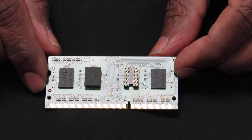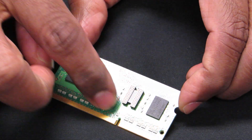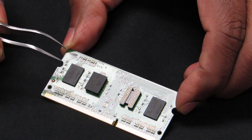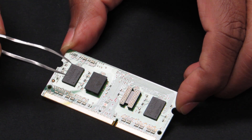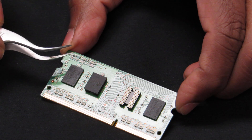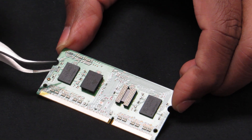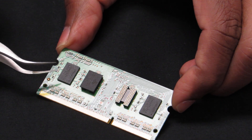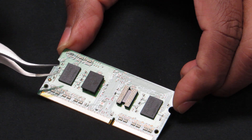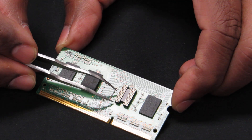This particular example is a memory card where the devices are soldered. If various device manufacturers' memory has to be verified, you have to remove the device, then clean the surface, reflow the new device back in, and do the testing. This process is much longer, very time consuming, and will cause other unintended failures due to the multiple reflow process.